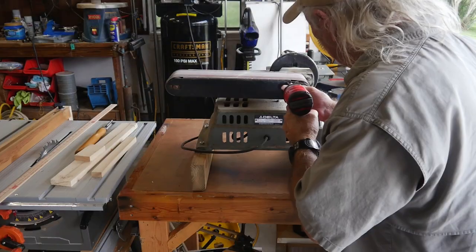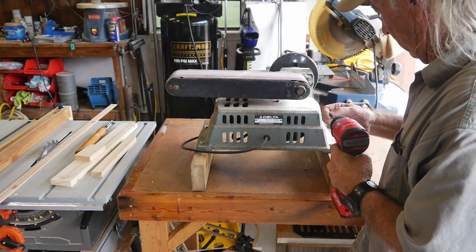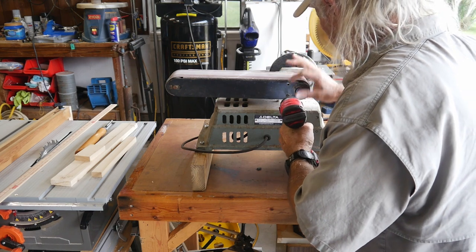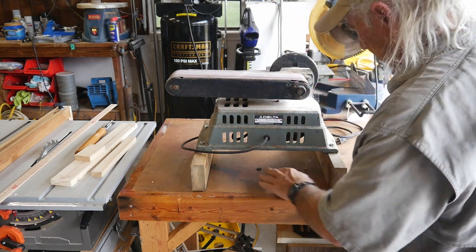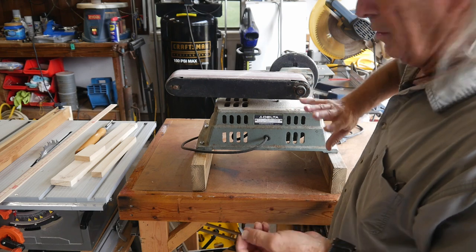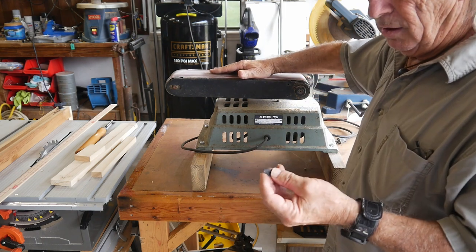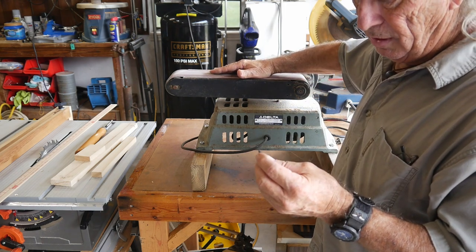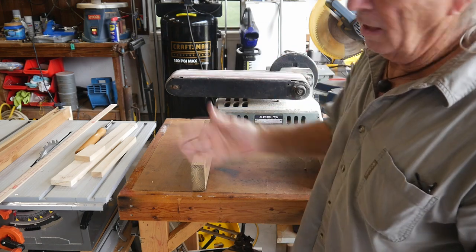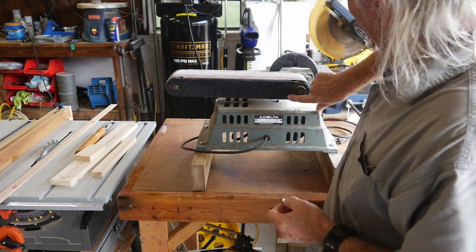Let's get these plastic pieces off and take a look at them. Apparently it was held with plastic — it's just falling away. These are small screws too, that makes things a little more interesting. That's just a thick heavy piece of plastic. There's no reason I couldn't 3D print a little plastic fence, but I have a couple problems with PLA — it's not great around humidity and needs a controlled climate to stay in really good shape.